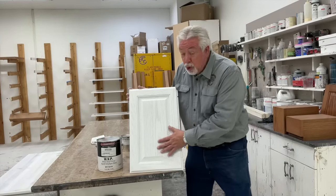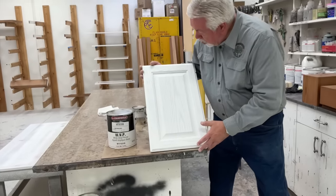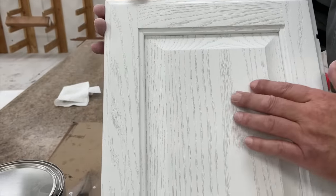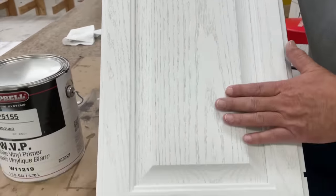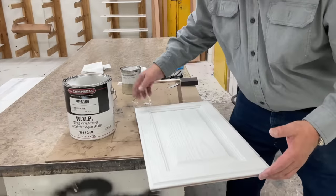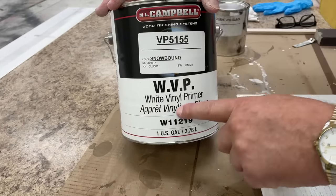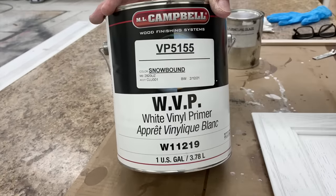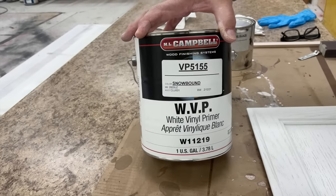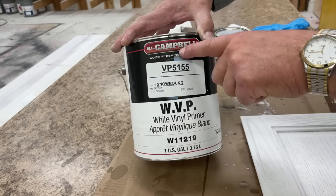We've just completed giving two coats of white vinyl on our door. If you look real close, you can see the grain is highlighted by our wire brush — this is where the glaze is going to hold. We're going to go ahead and give this a soft sand now to smooth out our vinyl primer, and then we'll put the glaze on. The vinyl primer I use is ML Campbell Vinyl Primer, and I have it tinted to a specific color for my job. This happens to be a job that has the color Snowbound — they mix it to match the color I choose.